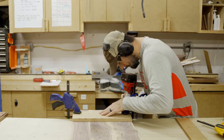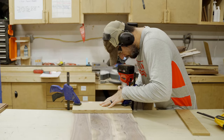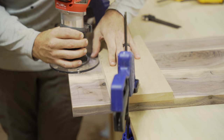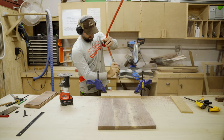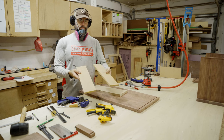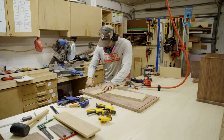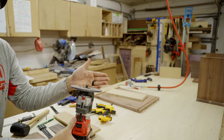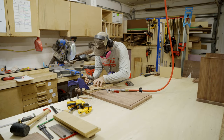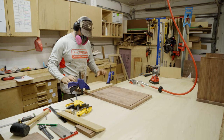So basically, this is what we did. We're using 3/4 inch wide dovetails and we only have a 1/2 inch wide dovetail bit. So we use the spiral down cut bit to cut a channel in all of the pieces. Then we came back, used the smaller spacer to cut the first pass with the 1/2 inch dovetail bit, and then set up the second spacer, which is a 1/4 inch longer, giving us our second pass at 3/4 inch.